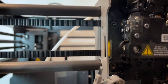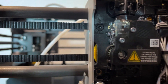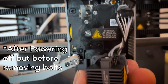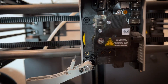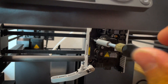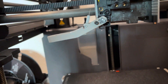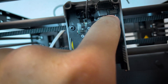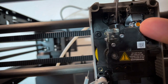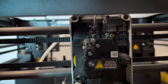The next thing I'm going to do is remove this bolt here and unplug the extruder, so I'm going to power off my printer because it's currently on. Before doing that, I actually removed the two cables over there for the hot end, so I took the hot end off. Now to take the bolts off — okay, looks like they're off. Let's see if we can remove this; just got some filament dangling. Looks like we're going to have to take off this connector here as well — it's just a quick pop. Nope, looks like I need to unscrew it a bit more.